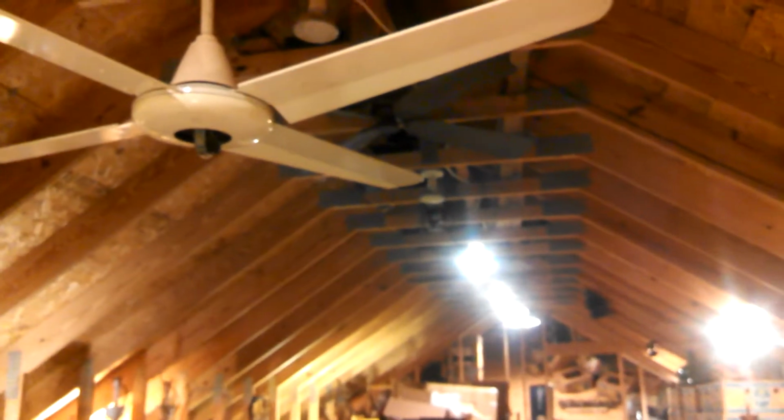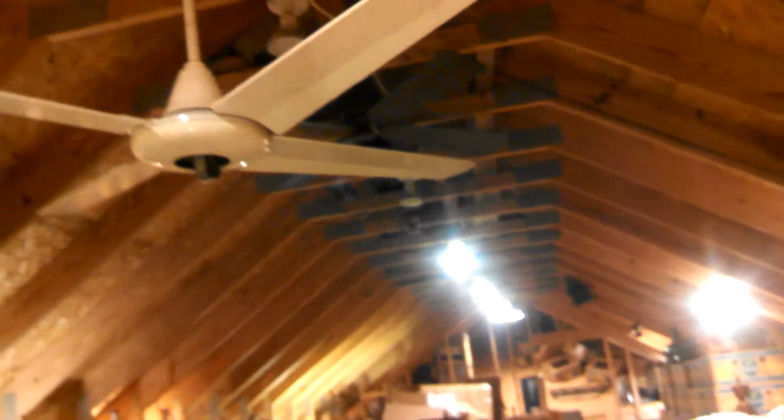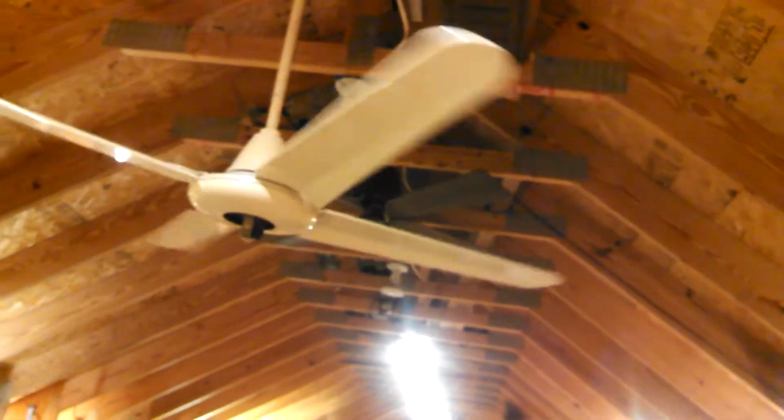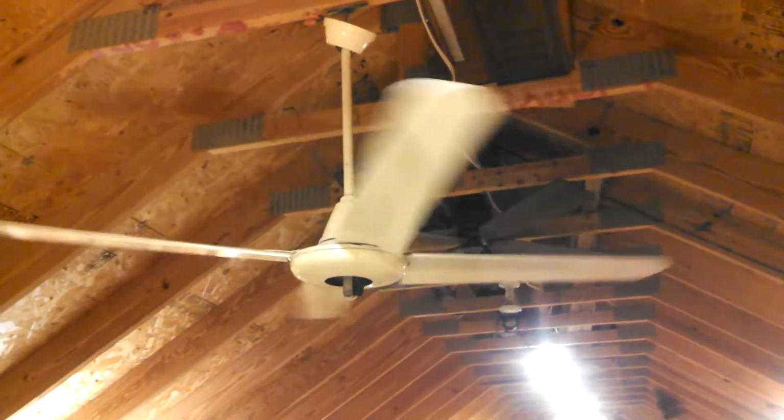So we got the amp meter, the wall control. It's set to low, so right now we're just going to turn the wall control to high, fan to low. It's drawing 0.35 amps at the moment. Now it's 0.34. It's funny how different these look without the switch cap.